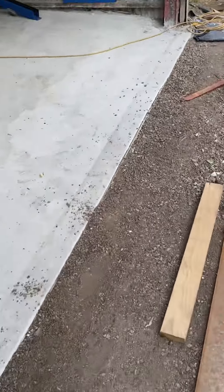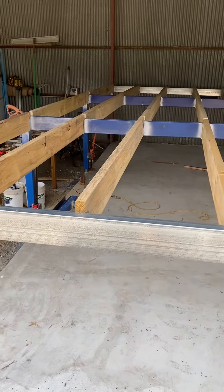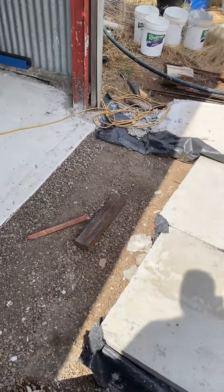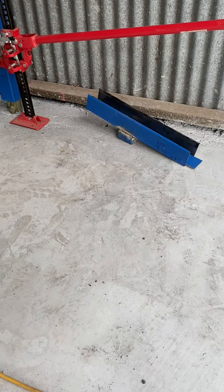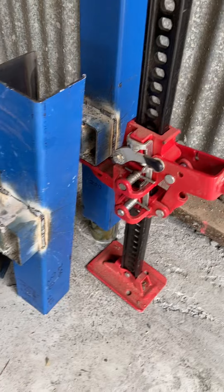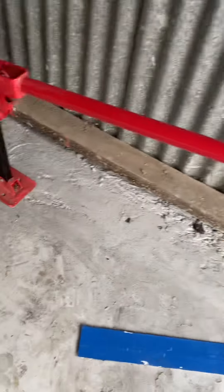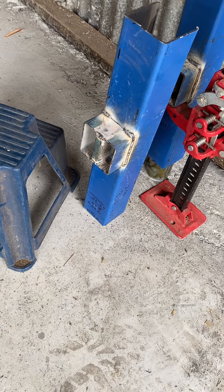Get up on the rock head — better look from here. So what you're going to do is lift up 600mm and then put these slices in. These are the little lifting lugs I made. Holding up quite well. Once that goes 600mm, that's going to go in. I'm going to weld it and then take the jacks off. I'm going to put a couple of extra props in there as well. Place that in and then lift it from this one next.